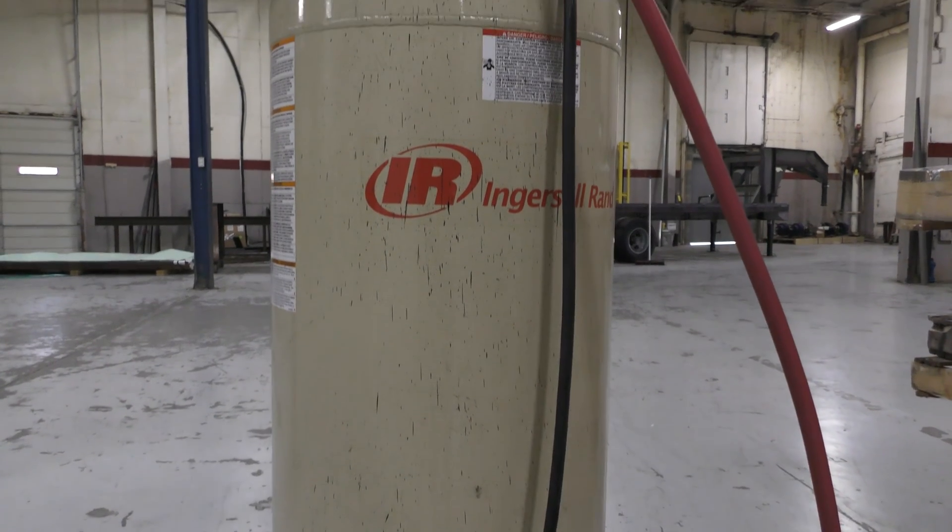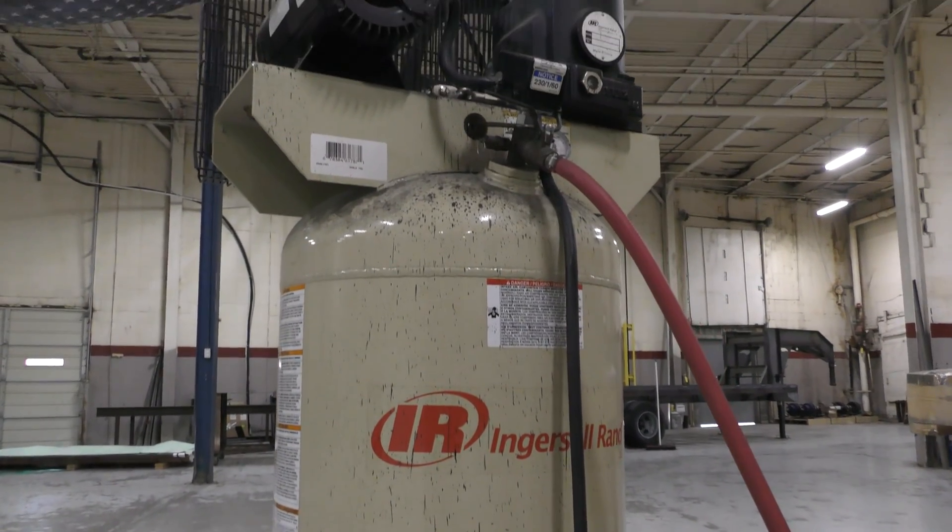We equate this to about a seven and a half horsepower compressor. We estimate every horsepower is about three CFM, so it will land you in the middle of that spec within 60 to 100 PSI, meaning you need about an 80 gallon tank.